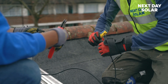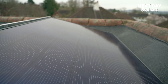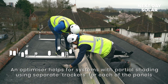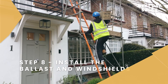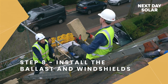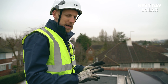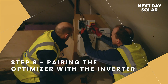Just a quick update from me on the roof here. We've got the bracketry in place and set up, we've got the first panel in, we've got the optimiser on and connected the cabling — connected an in and out to the optimiser and then paired up for each of the panels, so you've got cables for each panel ready. We've got the ballast tray in with 200 kilos of ballast coming to help keep the panels down. We've also got the wind safe shield on to deflect any wind. Last couple of panels to go in and we're just popping downstairs into the loft to set up the optimiser and pair it with the inverter.